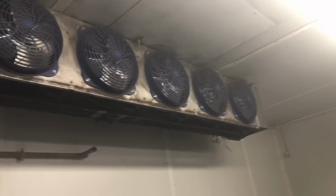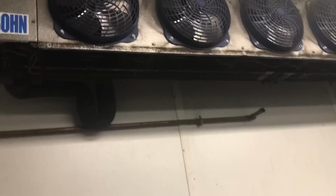So, just a PM on some coil washing, but we're gonna clean out the pan. Gonna wash this coil, do it right. Get all the front and everything too. When I'm done, this thing will look brand new. Blow out the drain line as well. It's going all the way down there. So as you can see, guys, that's just some of the heavy dust and crap just from brushing this off. So after we're gonna put our cleaner on and do this right. This thing probably hasn't been done in a couple of years.